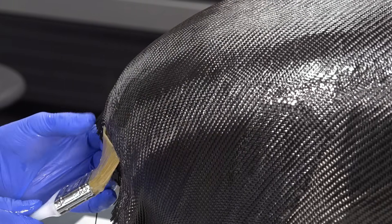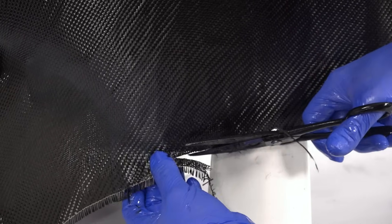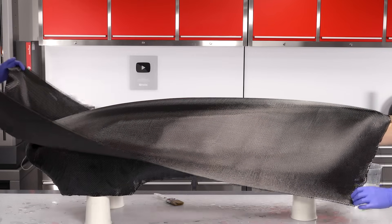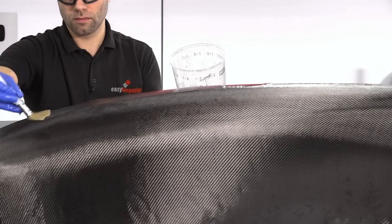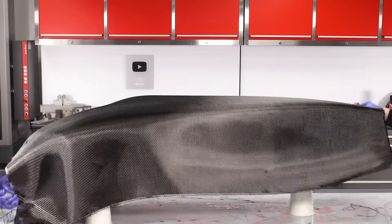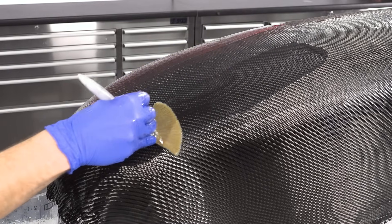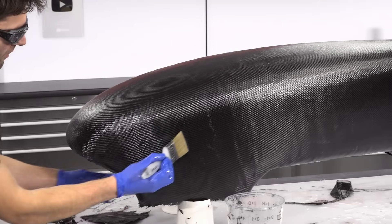This process can be used for almost any reinforcement type, including glass, aramid and carbon. You might be wondering whether this part could be vacuum bagged or even infused onto the former — if you're using a polystyrene former, the simple answer is no. Even at low levels of vacuum, the foam will collapse slightly, leading to distortion. There are ways around this using different materials for the former or laying a base ply, but in this video it's all about keeping things simple.